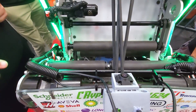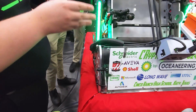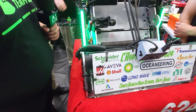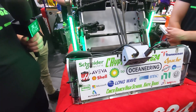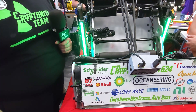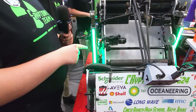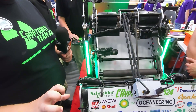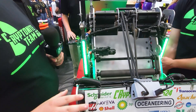We use quarter-inch aluminum that is bolted as an extension to our main drivetrain. For our drivetrain, we use SDS Mark IV modules with Krakens and magnetic encoders by CTRE. Our main drivetrain is a 20 by 20 drivetrain, and then the intake is a five-inch extension, making our frame perimeter without bumpers 20 by 25.